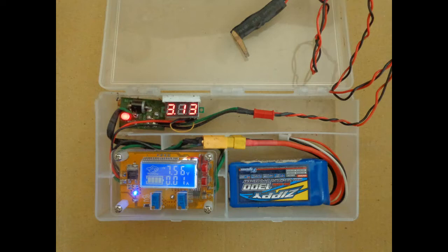The converter and the three-digit LED voltmeter are the only components we ordered from Banggood — links are in the description below. Everything else comes from the junk box: the little plastic box, connectors, heat shrink tubing, hookup wire, and a heavy-duty diode on the output leg. So the only things you'd really be ordering are the DC-DC converter and the three-digit LED voltmeter.